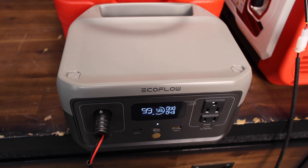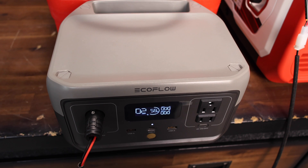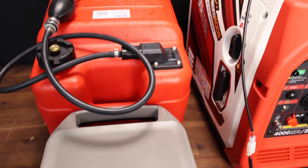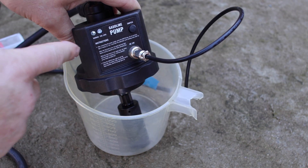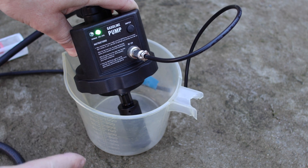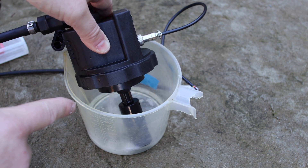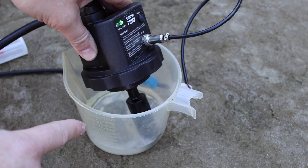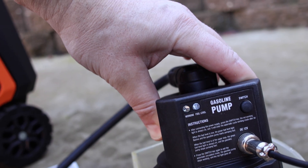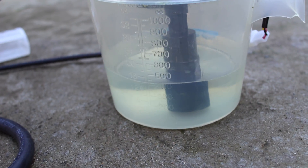After running through a couple of tests, the pump draws a consistent 75 to 85 watts. Looking at the pump outside of the unit, you turn it on, it takes a few seconds to analyze the fuel level, and since it's empty, it kicks on. It will run until the fuel level comes up high enough to shut off, which I estimated at about two minutes to fill a 1.1-gallon tank. So this will only run maybe every three hours, depending on your load.